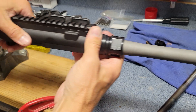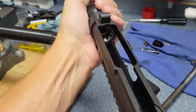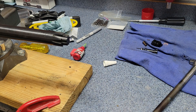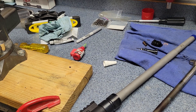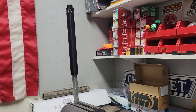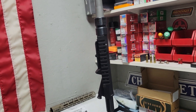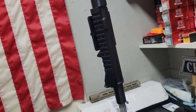I'm just going to pull this out of here and look in there - I've got a little bit of that Loctite coming out this side but really not much. I want to make sure I clean that up while it's still wet. Then I'm going to put this thing upright, put the barrel back on it, and just leave it sit like that. I usually leave it sit overnight to let that retaining compound dry, and then we should be good to go.